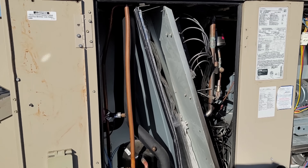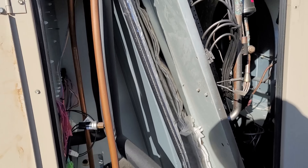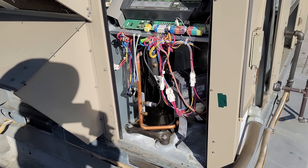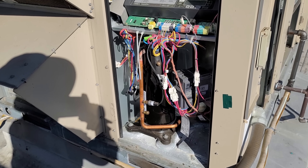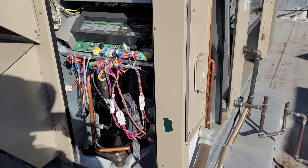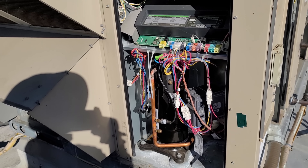With that being said, we're going to go ahead and replace the TXV and the dryer. We're actually going to change the oil in the compressor because it's been sitting for so long without refrigerant that I'm worried the oil is completely saturated with moisture. Before we go any further, I'm going to power the unit up real quick and bump the compressor to make sure it still functions.